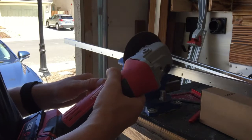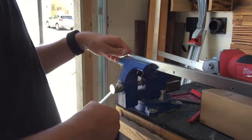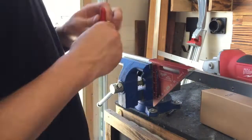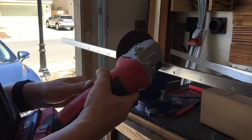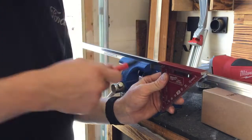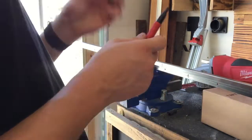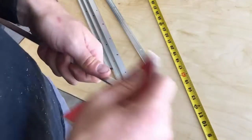For the installation of the pieces of plywood to our baby girl's bedroom wall, we had to purchase two items. One of the items is a j-bar and the second item is mirror clips. The pieces of plywood will be sitting on the j-bar, so these were cut to the width of the plywood, which is two feet.